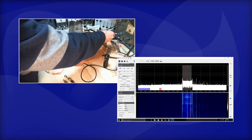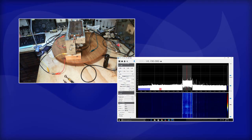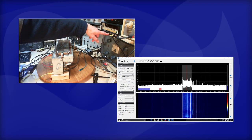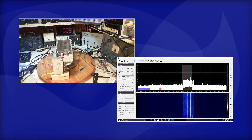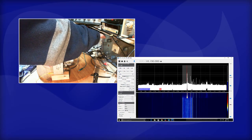Okay, so now the signal generator is like it was never actually connected to the radio. I just accidentally connected it to my internal FM antenna, thinking it was the radio. You know, that's really good. I think we can really work with that. That's a thing of beauty. It seems to be shifted off to the right a bit. We can check for the centering of everything by just turning that down. See, it is off to the right.